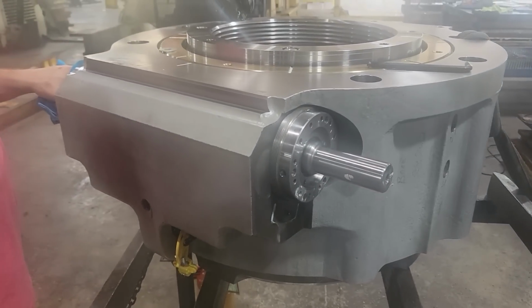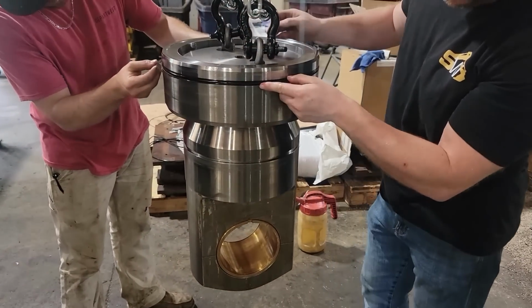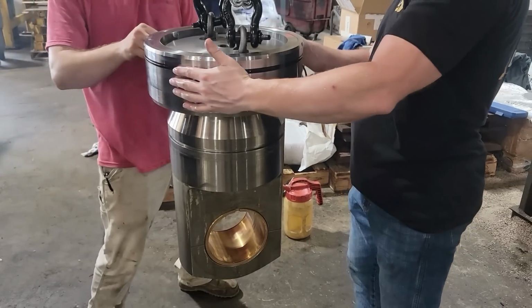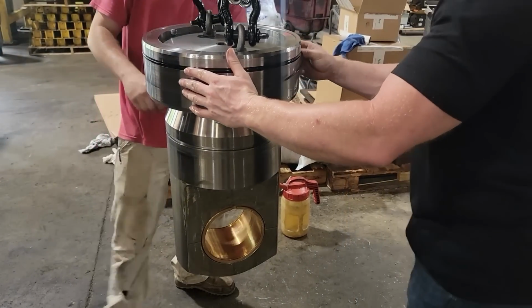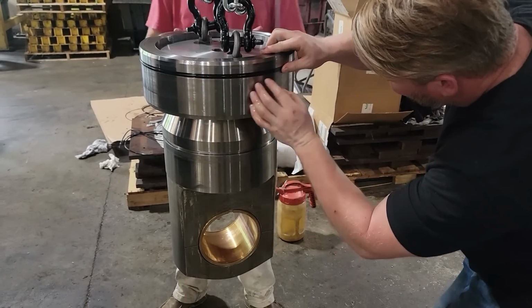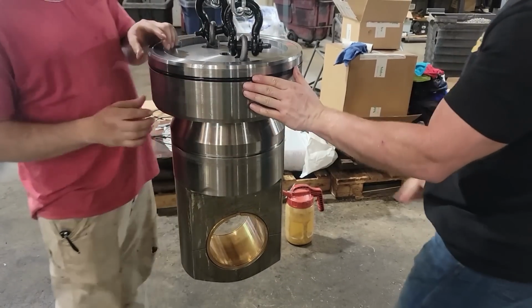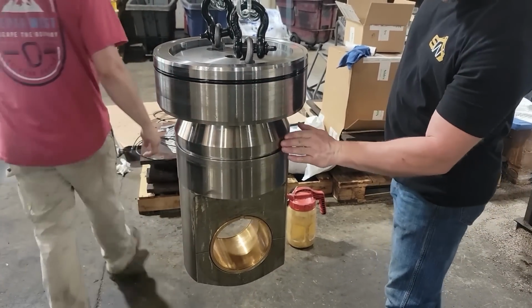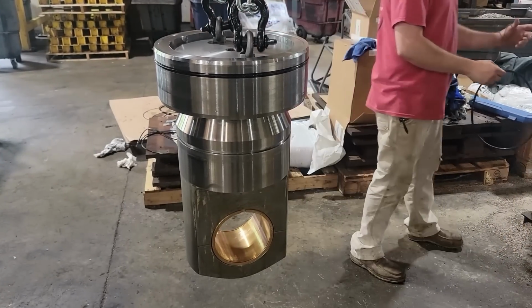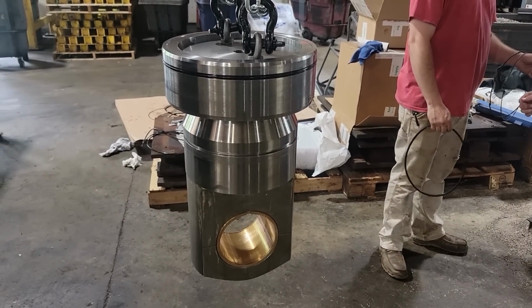Good on it. So this is the piston. That right here is actually what raises the die up and down without the press stroking up and down. It's just in case you ever get in a bind and you got to raise that ram up and can't. You can put hydraulic fluid on this and raise it up to get your die out of a bind. It's just a big piston is all it is. So the next one we pull, all we got to do is pull it straight up instead of loosening like we did last time.